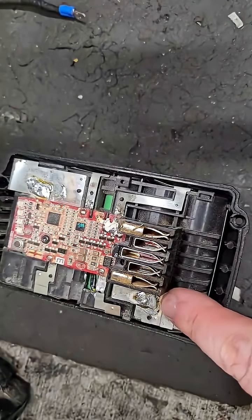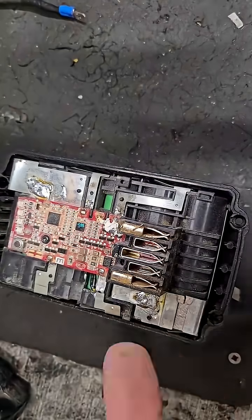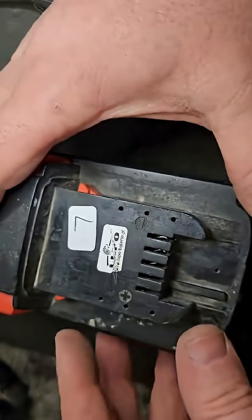It just burnt out, so what I'll do is connect a little bit of nickel strip across there, soldered across. It'll still be a fusible link because it'll be a lot weaker than the rest, and it'll burn out in the case of an overload. So that's good news — number seven is the fusible link.